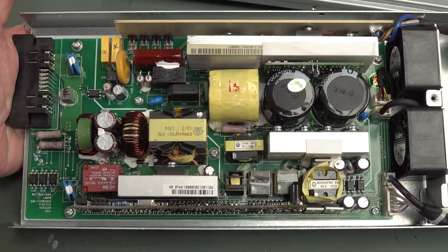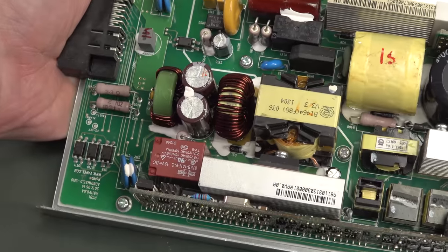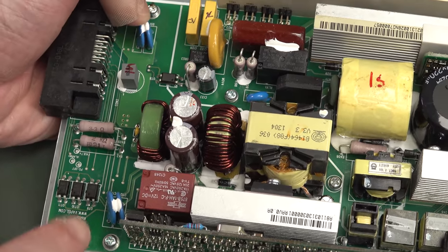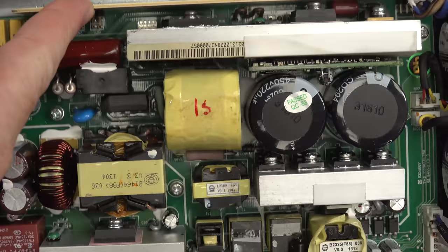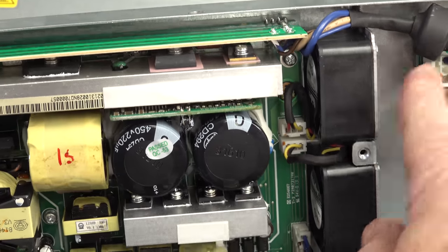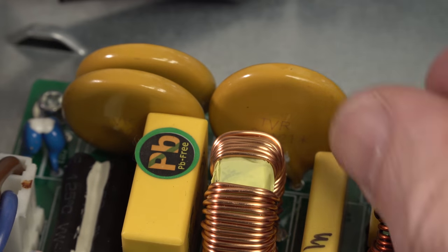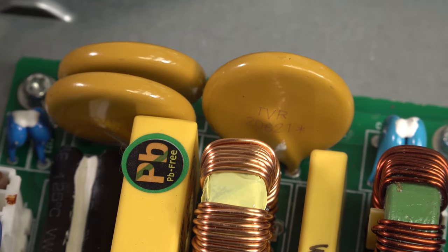Designed and manufactured by a company called Vapel. Never heard of them, but look, they've got a relay down in there. Real fair dinkum relay. Okay, we've got dual MOV protection. It just looks really gorgeous. Look at the single-sided phenolic PCB up here. They're just using that board there just for the mains wiring. So the mains starts over here. Look at the protection. Look at the size of those MOVs. Oh, they just suck up the joules. Wow. Thank you very much.